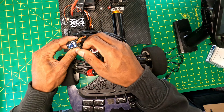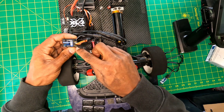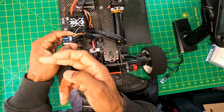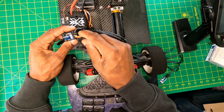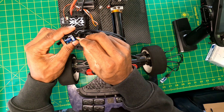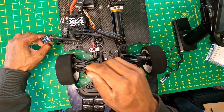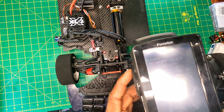I have my steering servo on channel one. My negative, which is away from the casing, is on the right side and positive to the left. Same thing on this connector — I've got the wire flipped so ground is on the right side, power to the left. Also on this one, ground is on the right side and the aux wire is to the left.